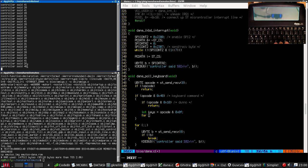Oh, 40. Ah, right. It's reporting the number of keys pressed, with 0 meaning no keys pressed. So it's not giving us key up, key down events. This means we're going to have to keep track of what keys are pressed, though I don't know yet what the Atari wants. So